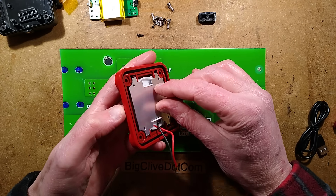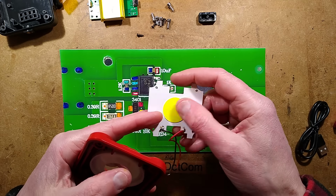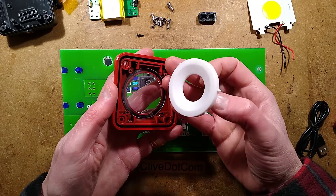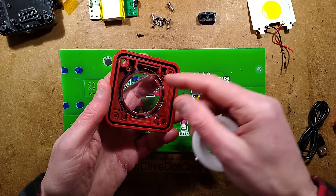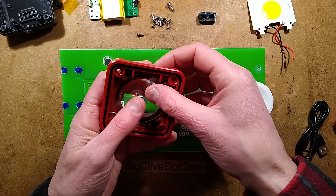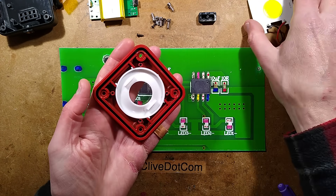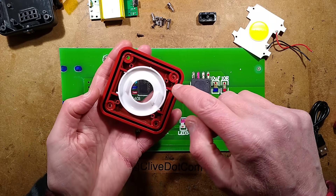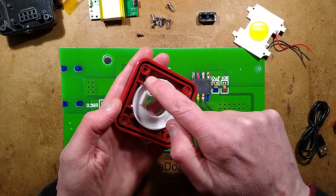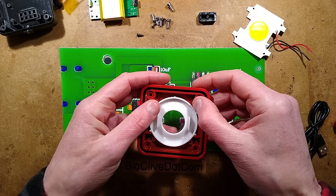That also keeps it spaced away from the heat of the aluminium heatsink for the COB array, which has 30 flip chips on its chip-on-board array, all in parallel. There's a white plastic reflector and then a clear plastic lens with a rubbery polymer seal. Worth mentioning that when the COB array is screwed in, one of the four mounting positions did not have a screw in it - and it's the only one that's not cracked. All the others have cracked, likely a screw choice issue.